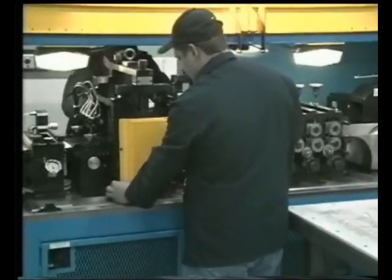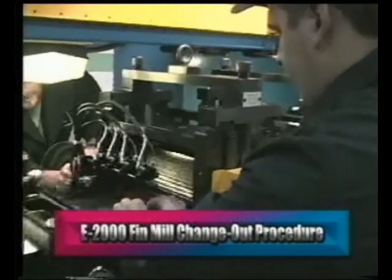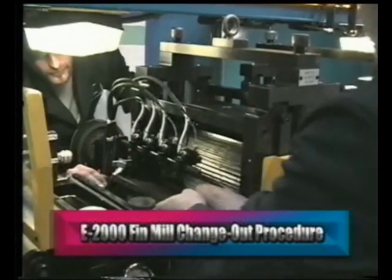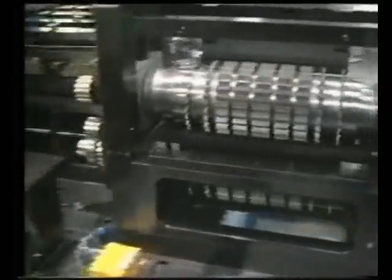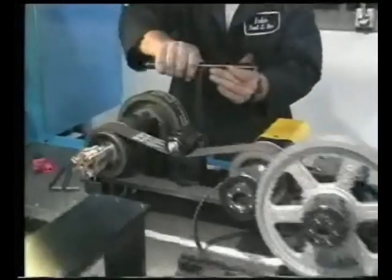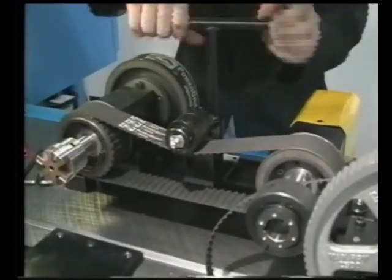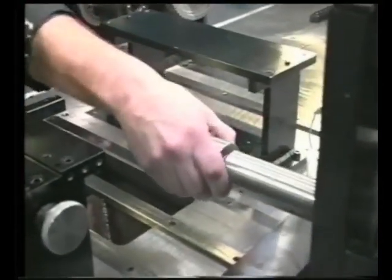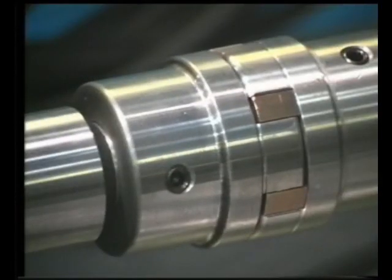The E2000 mill will increase a company's production because of its ease of setup time, operational time, and maintenance. It has the remarkable ability for quick change of its roll tooling and gathering system modules, which can easily be completed in 10 to 15 minutes. When ordered with our adjustable stock guide package, the fin mill has the versatility to fabricate different types of fin strips. Design changes such as fin style, separator width, amplitude, and fin density can be completed easily in 20 to 25 minutes.